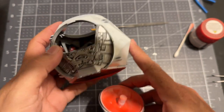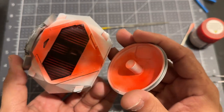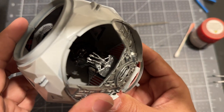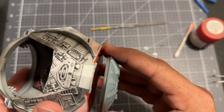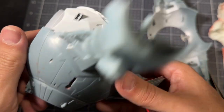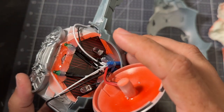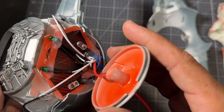Small changes and updates throughout this project: to get a deeper red coming up from the bottom, I added some clear red to both pieces here, so now that LED down here will have a lot more red to work with. One note: when you put this together, the post for the stand goes directly up against that clear part, so to put a hole in for the wire you can't come in from the top — you have to come in from the side. We have an LED on both sides pointed back at the holes where we'll have a clear part, two green LEDs pointed out towards the blasters, and two LEDs to illuminate that red floor.